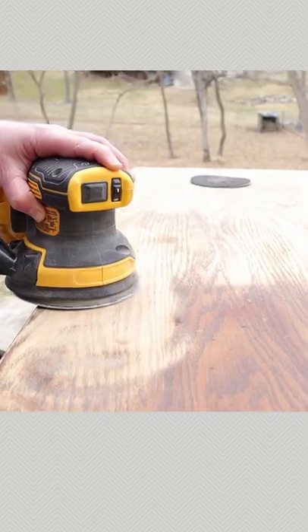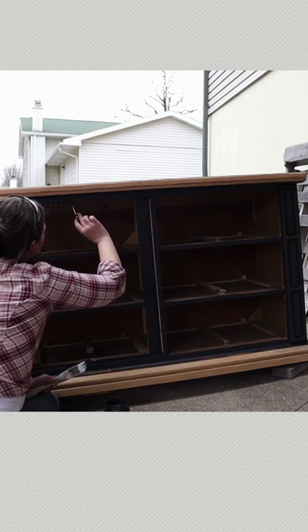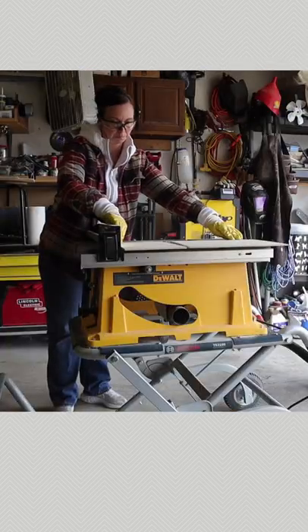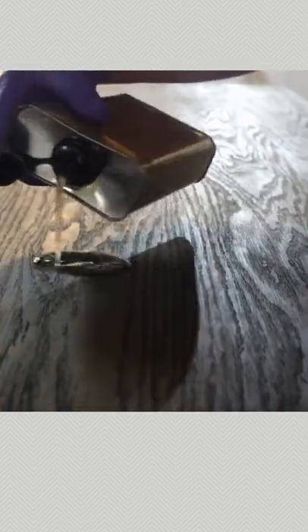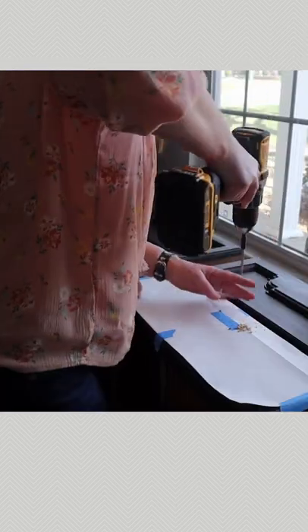This is how I turned a free dresser into a TV stand. First I sanded the top, painted the whole body in Fusion Mineral Paint in Ash, and did a wash to the top. I cut wood and made some shelves, then top coated the whole thing in wipe-on poly. I added some cute hardware from the hardware store.